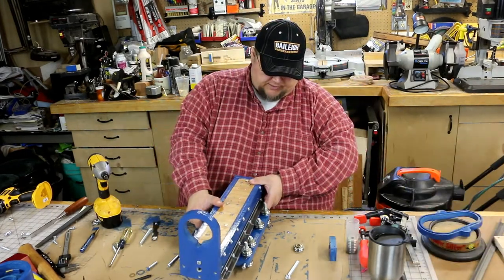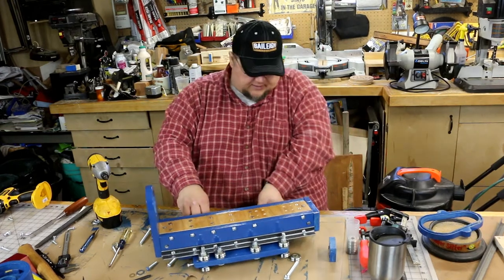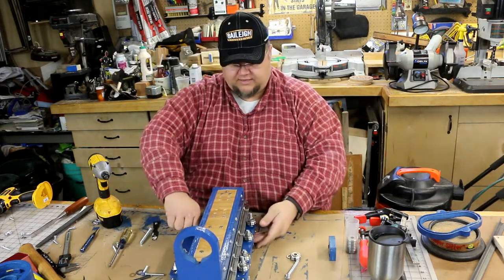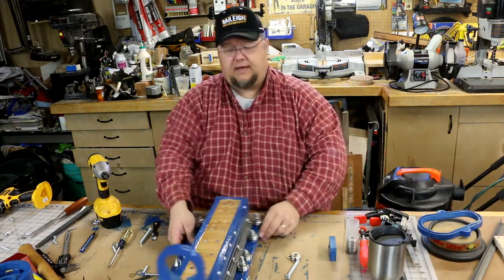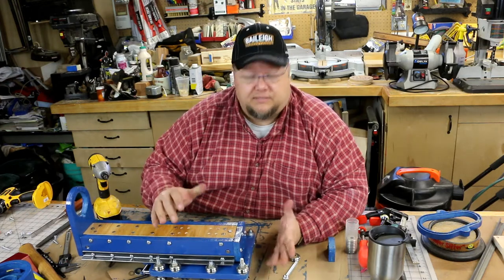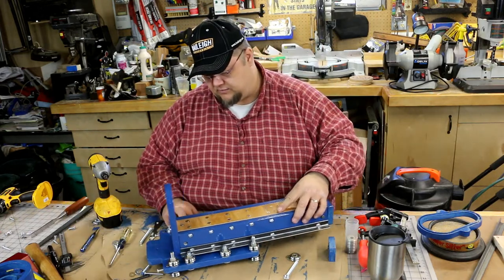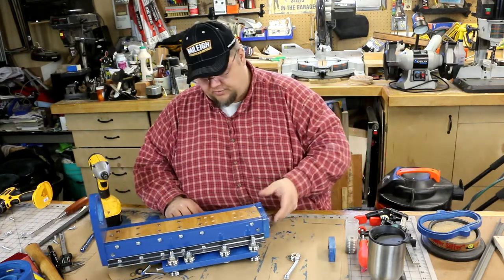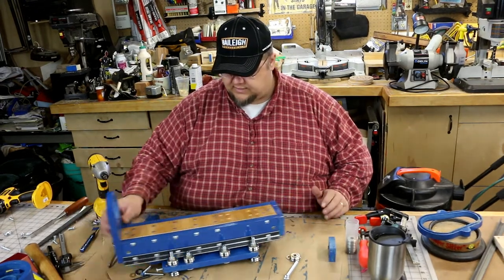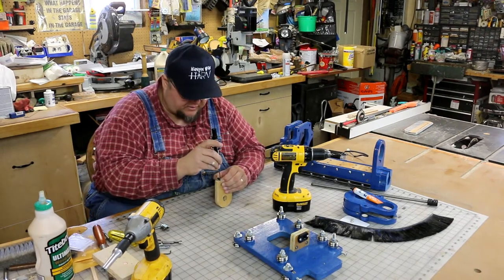In my upgraded design I've got more bearing surface — instead of just having two on either side, I went with four down one side that are fixed and two on the other side for adjustment. If I raise it up, I'd be off the bottom bearing which normally would make it unstable, but with this I still have three here plus two over there. Same going down. It gives me a little more travel in the Z-axis. That slides real nice. I'm getting started by eyeballing the hole I need to drill for the barrel nuts in the X-axis lead nut plate.